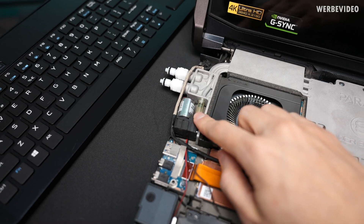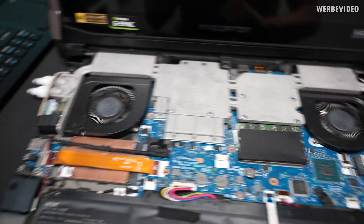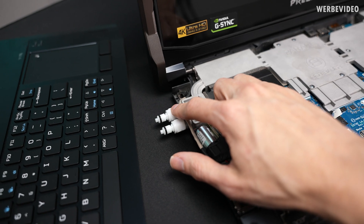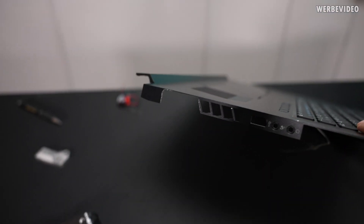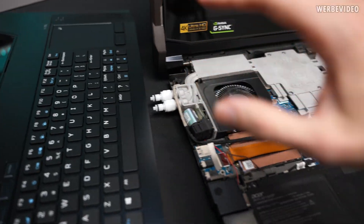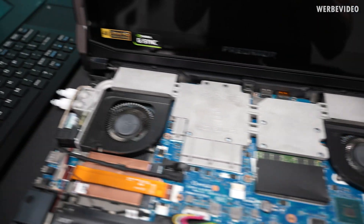That's why we decided to go for this tiny pump on the side to have a closed loop when you completely close the laptop. And then we have these quick connect fittings right here, which make it possible to attach our external water cooling loop. We made a cutout in the case, which you can see right here, so it's still possible to use the original case except for this tiny cutout. No modification had to be done to the notebook so far.